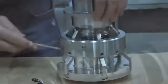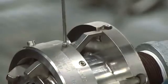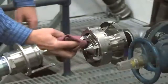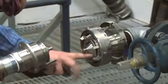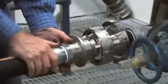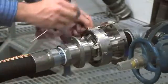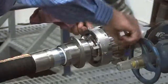To attach the two halves of the unit for operation, begin by tightening the cap screws, which will open the cams. Carefully clean the flange and O-ring seal around the poppet, and then put a little seal lubricant on each side. Once you have the stop bar lined up, press the two halves together until firmly engaged. While holding the two halves together, remove all of the cap screws, releasing spring tension and allowing the cams to move back into place.